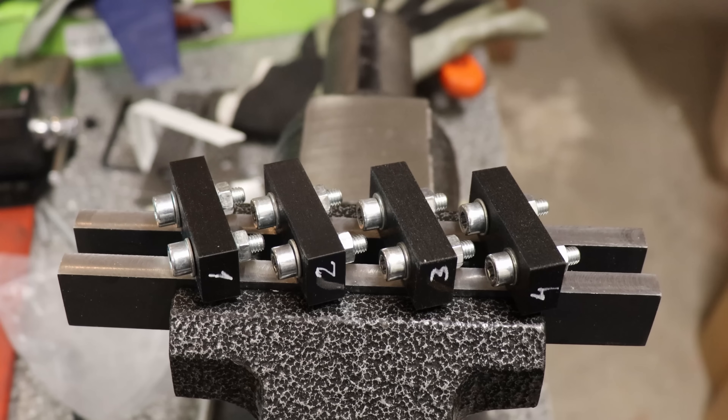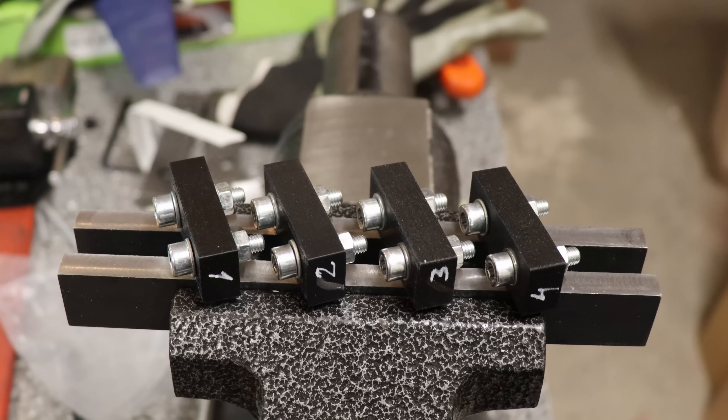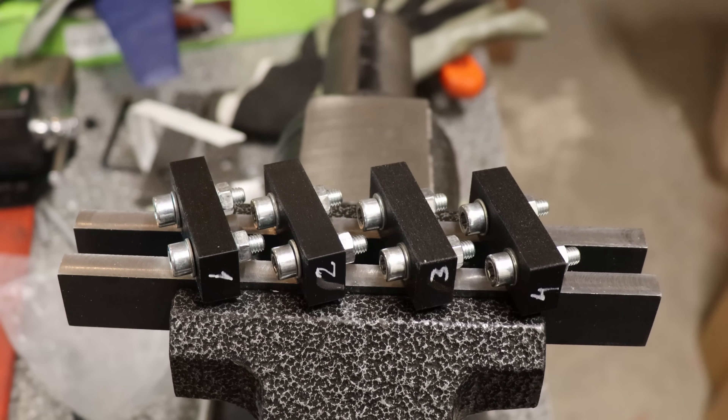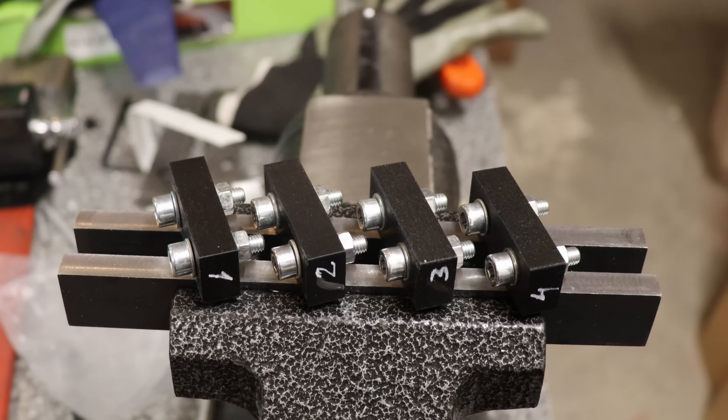I'm a little confused here. The bigger untightening torque is not surprising because static friction is always bigger than sliding friction, and if there's not much stress relaxation, the untightening torque will be bigger. But I was expecting bigger untightening torque with fiber reinforced filaments. The regular ones performed better — opposite to the creep results. I initially thought there was bigger friction with regular materials, but the friction here is between the bolt head and the washer, so I cannot fully explain this result.